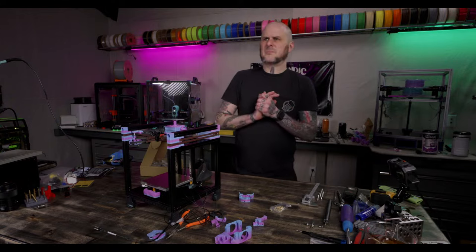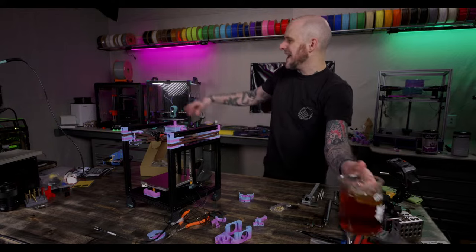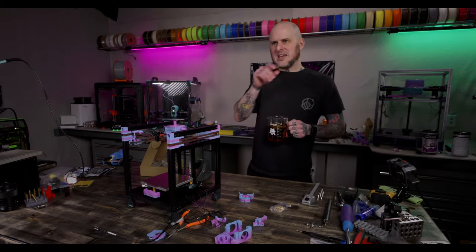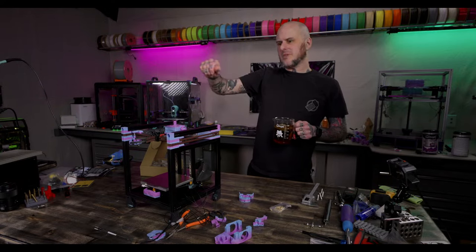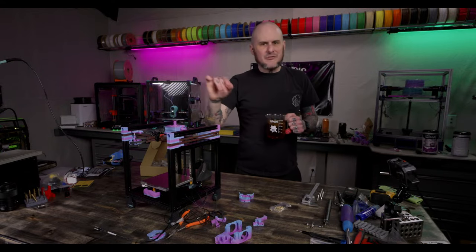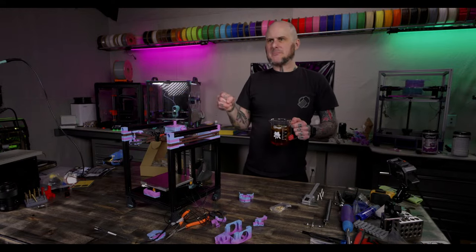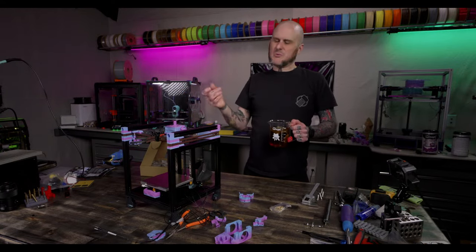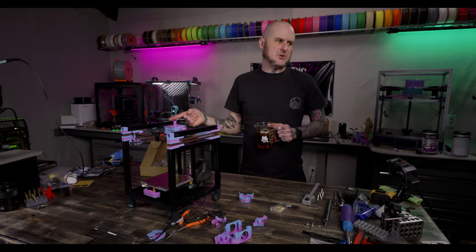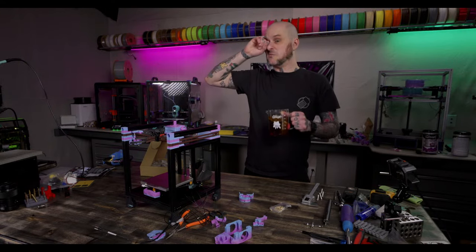Nuno, welcome! They make great extruders. I've used a couple of them. It'll be my first time playing with it. I love the LGX extruder. I'm a fan of the LGX Lite. My only thing I don't love about the LGX Lite is, I like the lever that just goes to different tension settings. Totally like that, except sometimes I want to be able to tune in between the settings, you know? Like TPU, I've had bad luck with the LGX Lite and TPU because you can't dial in the tension setting. You just have two settings and neither seems quite right. So yeah.